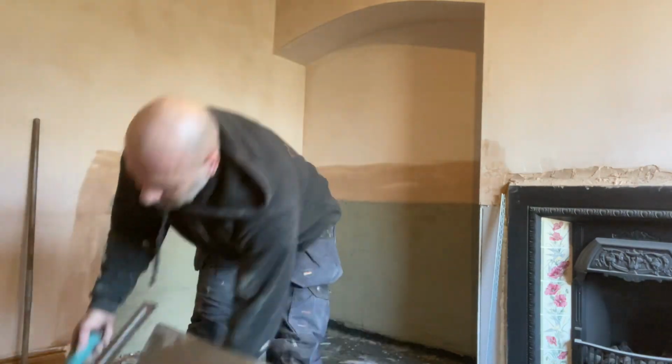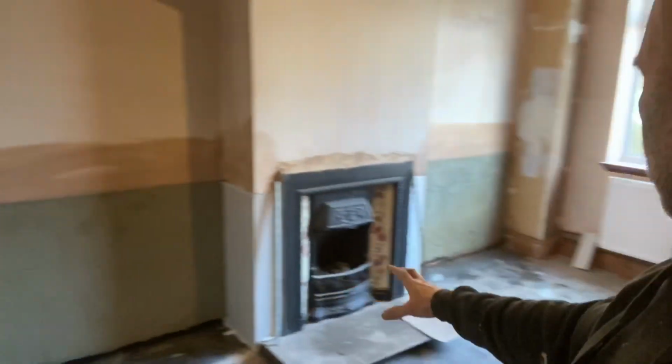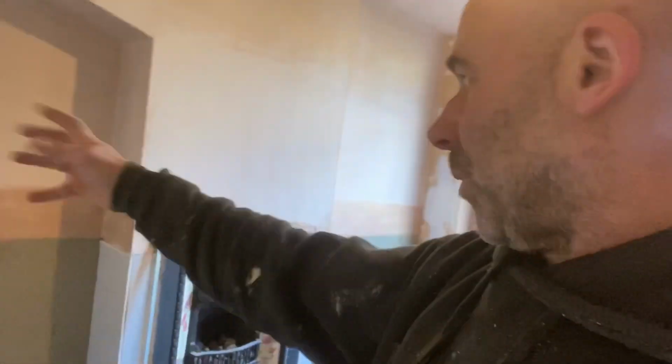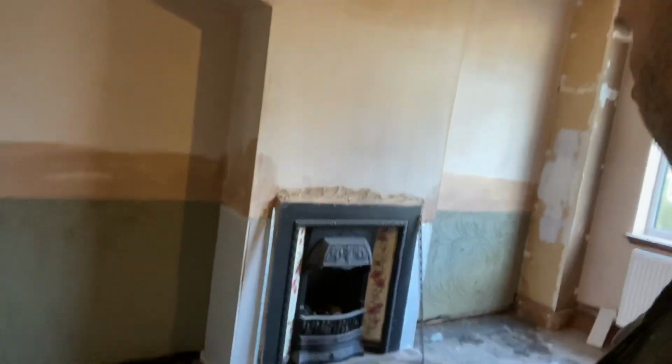So there you have it. All sorted. Straight from this end, so you've got backing plaster on. James is dying to get on camera, that one. So backing plaster on, fast system on the side of the chimney with liquid DPM on it to stop any sulfates coming through. PVA tops. I'm just gonna cut them. Well, I'll rub these up like I've done that one, and then cut these ready, get a clean up, and that's it.